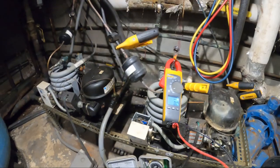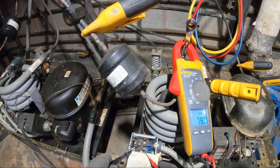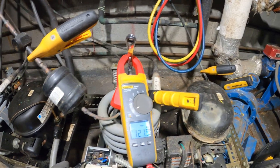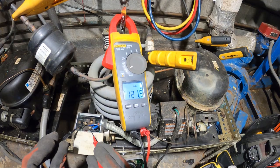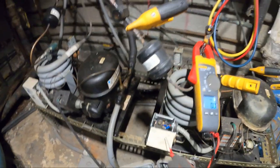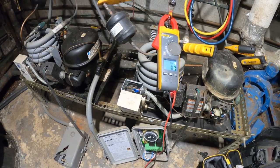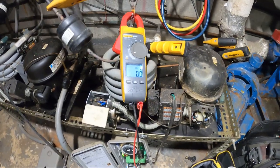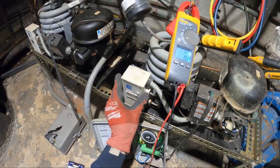Can't even get that cover off. Let's check this pressure control. You can see how we have voltage across that right now — it's the pressure control holding us out, so it's shut down on high pressure.